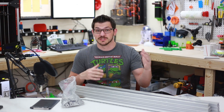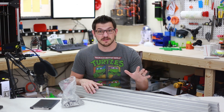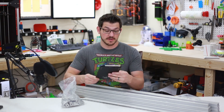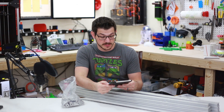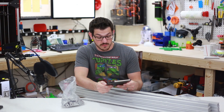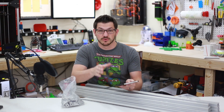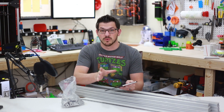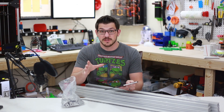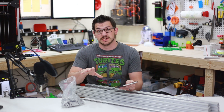I'm starting with Tech2C's base build, just increasing the Z height, and all other parts are exactly identical to what's on the Thingiverse page. For what I need, I've written down: four 340mm pieces, four 303, four 500, two at 285, and one at 135. The two 285s and the one 135 are for the bed — that's the little U bracket that holds your heated bed. Check out the configurator and it'll tell you exactly what you need to cut.